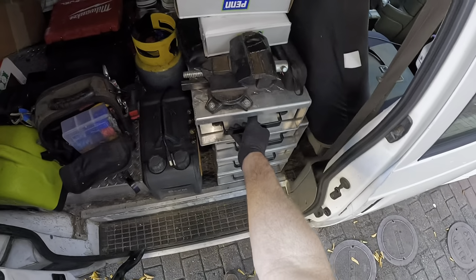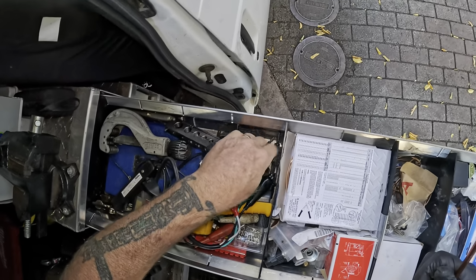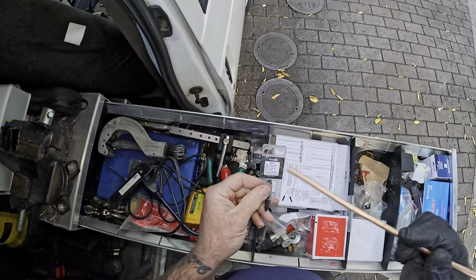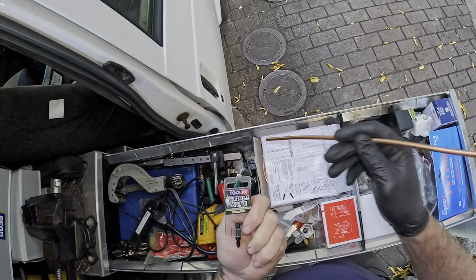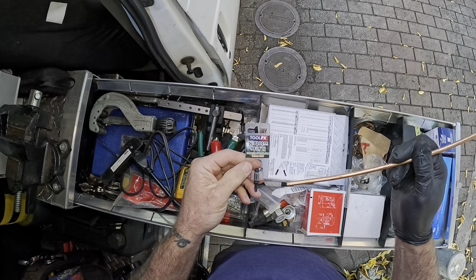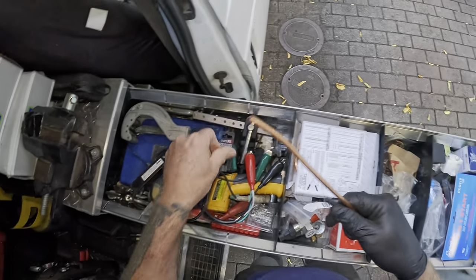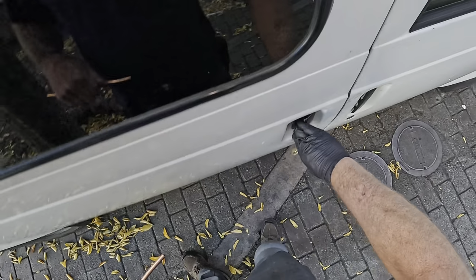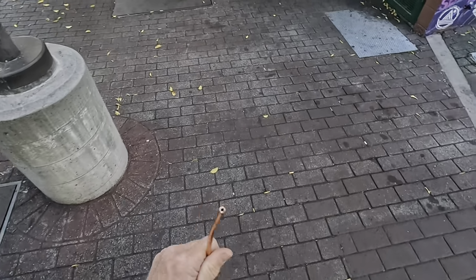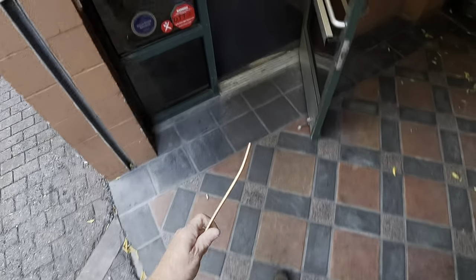Back up there. Oh yeah. There it is. Someone had asked me which swedgers I've been using for the drill, and it's just these cheap ones off of Amazon. Tool PX, copper pipe widening tool. And that's gonna be this one. We'll go up there and we'll cut it to fit. After we get all the pipe fitted, then we'll come and grab the nitrogen tank and hook up the nitrogen before we braze it all.